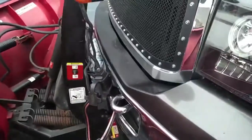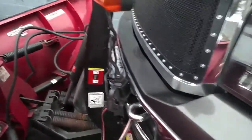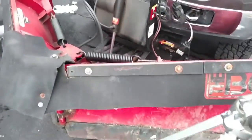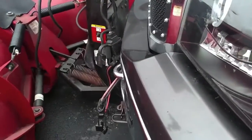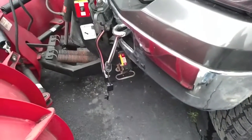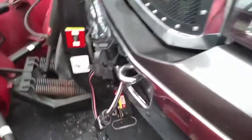This is basically going to come up — you're going to hear the pins pop, and then we're going to go the other way and push down, it will lay it down and then we're all set. One thing to keep in mind: see how I have the plow in a V? This is very important for taking it off. When you have the plow in the V, it puts the plow pretty much in the exact position you need in order to get the plow mounted next time. If you don't have the plow in the V — let's say it's flattened out or in scoop mode — that drops these mounts down lower and then you can't easily, without lifting up the plow, get it mounted to the truck.